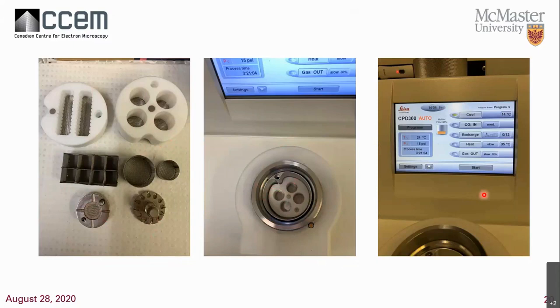After the final fill with liquid CO2, the chamber is gradually heated to 35°C, causing the pressure to rise to a maximum of 79 bar — reaching the critical point of CO2. Finally, the CO2 gas is slowly vented while maintaining 35°C, which prevents the gas from returning to a liquid state while the chamber returns to atmospheric pressure. In this way, biological samples can be gently dried to minimize drying effects as much as possible.